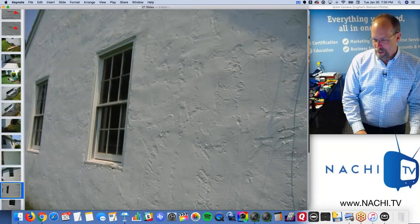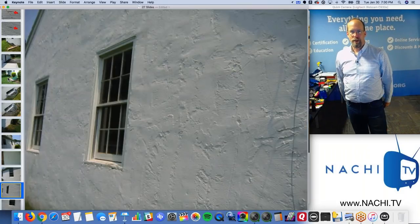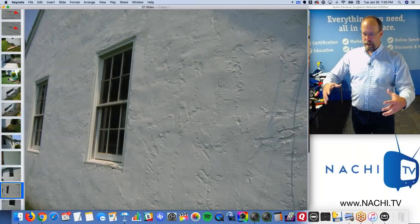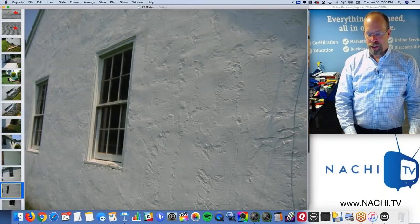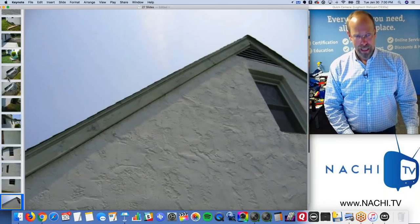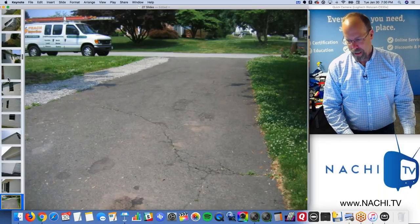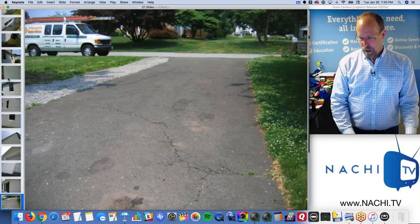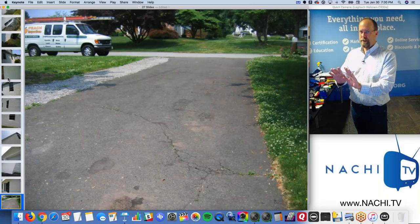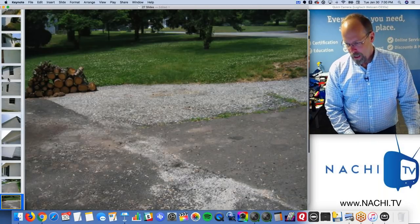Okay, now I'm on the outside of the house. I used to own a house like this. This is concrete masonry units, concrete block, mortared together, and then they have a parging of cement on the outside, a couple coats, you paint it, it lasts forever. Maybe you'll get some settlement cracks, maybe not. It's easy to repair. I'm just looking for large displacements. If I can stick a pencil through, that's an opening.